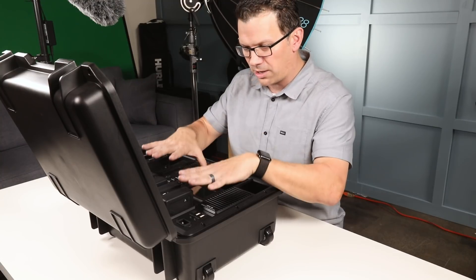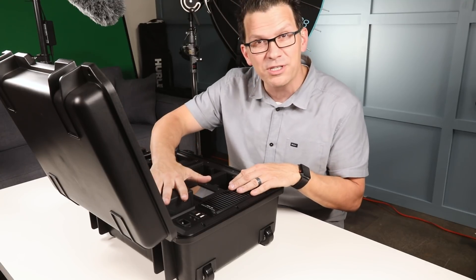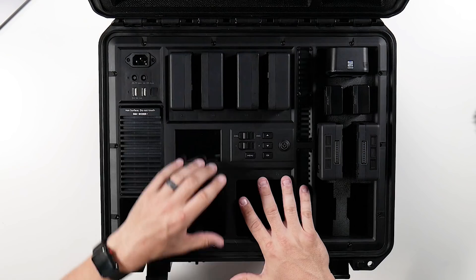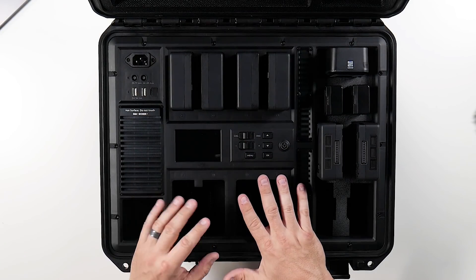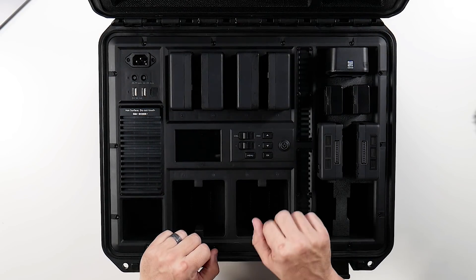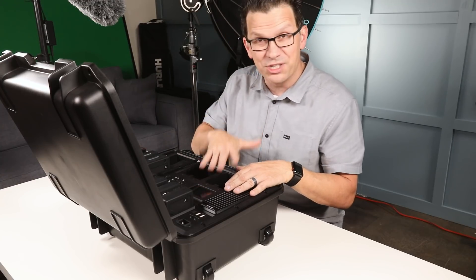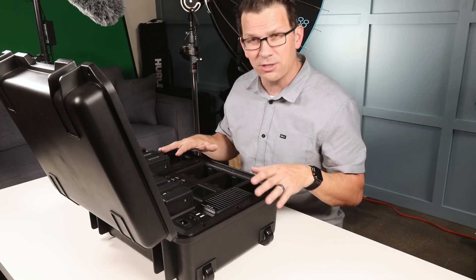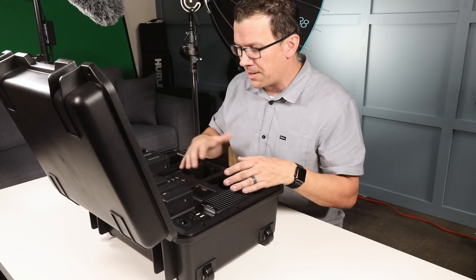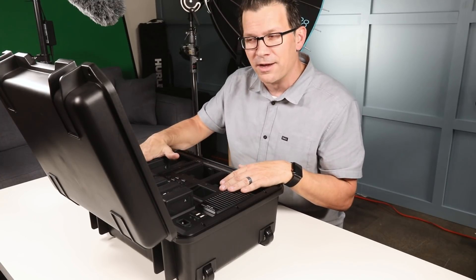This will charge all eight batteries at one time. Or you can put it into quick charge mode, which takes batteries from 0% to 90% in 35 minutes — four at a time. What it does is find the two groups with the highest charge already. So if you have four batteries at 20%, 20%, 50%, 50%, it'll take the two at 50% and charge them from 0% to 90% in 35 minutes. I asked the DJI engineers — they said you don't want to do quick charge all the time, but if that's what you're doing on production, it doesn't actually degrade the battery life. They've built the electronics into the battery so it doesn't degrade it.